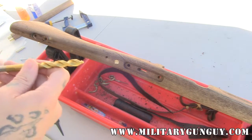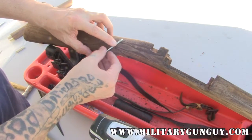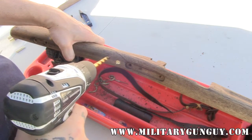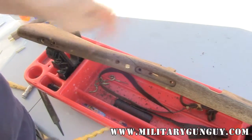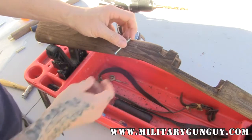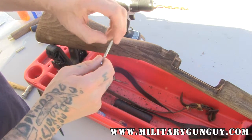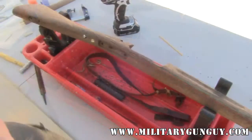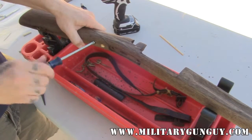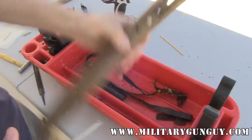We are back and we've determined that somebody had already done a repair on this prior to us getting it. So we're going to put a screw right in there from the inside and then use a wood dowel to clean up the hole. The first thing I'm doing is slightly countersinking the repair hole, then I'm going to test the angle. This screw might be a little too long — yeah, it's going to be poking out the top, so I've got to get a smaller screw.